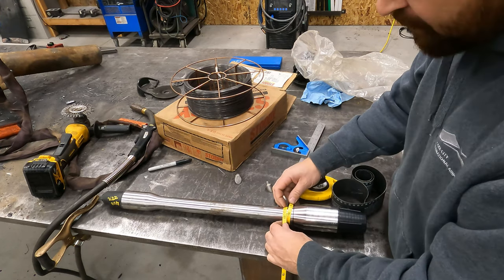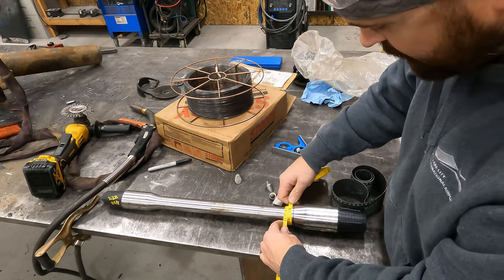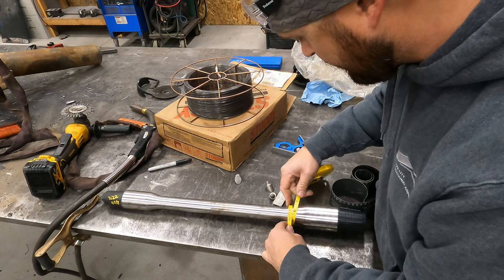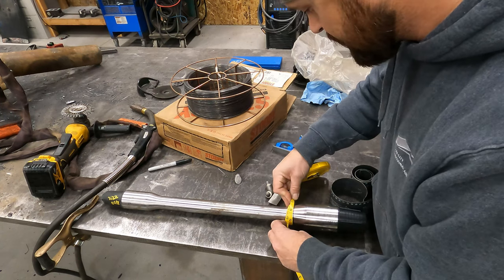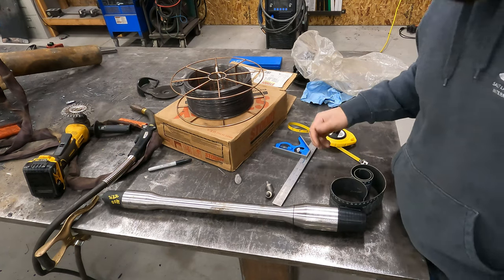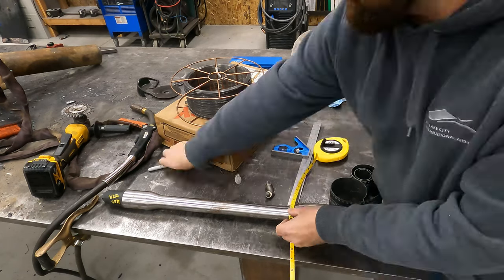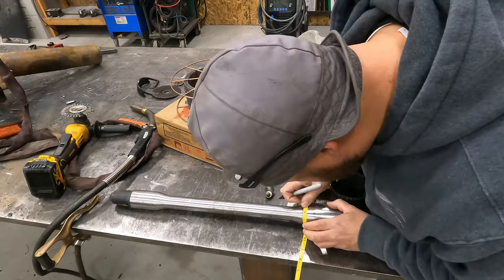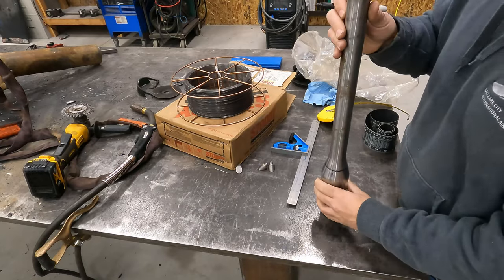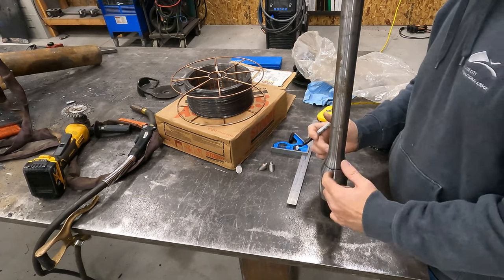And then usually what I like to do on something like this is I'll burn a foot. And when I say burn a foot, I mean you start at the 1 foot mark. So I'll start at the 1 foot mark. So we're exactly 6 inches there. So that should be 2 inches. So if we lay it out every 2 inches. Okay. So it was exactly 6 inches, 2 inches, 2 inches, 2 inches. We got our three segments there.